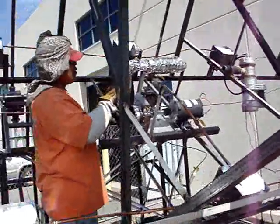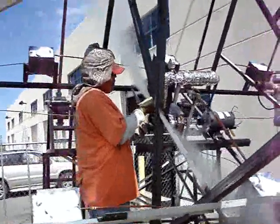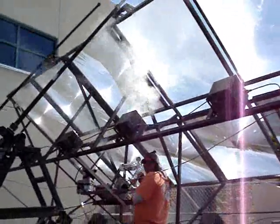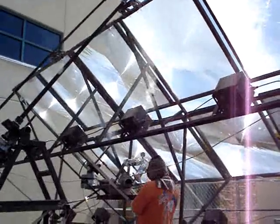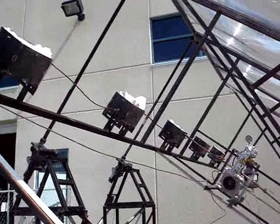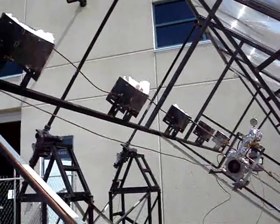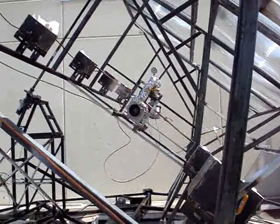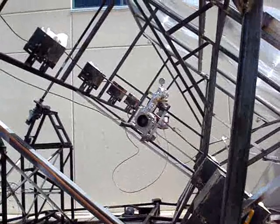Stand clear of your valve there and vent it please. Still climbing — 200 PSI. We had a line blow there — 200 PSI and we lost a line up there. Let's turn the array away, but you can see the incredible volume of steam and the pressure we have here. We're going to divert it and shut her down for now.